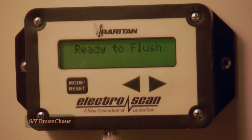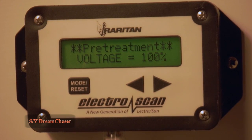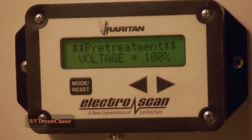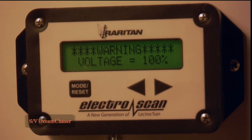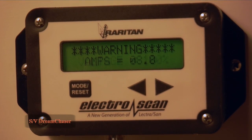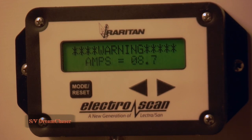With all the wires connected, it's now time to test the unit to make sure it's ready. We go ahead and start the unit. It does its pre-treatment for 30 to 45 seconds, and then it starts climbing up in the amperage. We need to see a minimum of seven amps in order for the unit to treat. As you can see on the screen, our unit is bouncing back and forth between about eight to ten amps during a treatment cycle.